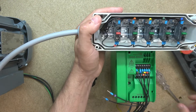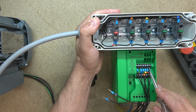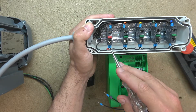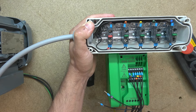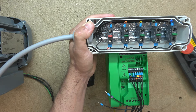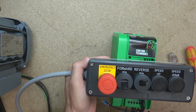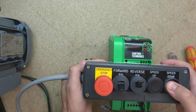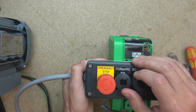Let's talk about the wiring. Terminal 9 is my supply, which goes to my e-stop and goes back to whichever terminal we set up as enable — remember the diagram. From there it comes through the e-stop and sends power to all the switches, which correspondingly send signals back to the terminals. Very straightforward. Let's put the cover on and see how that works. So forwards, speed control — as you can see I'm going down, and it's slowly going down as we hold it. The same goes with up. It locks each other out if both switches are on.